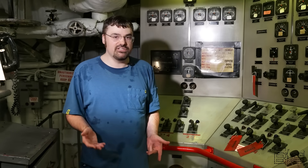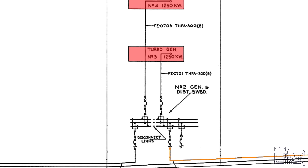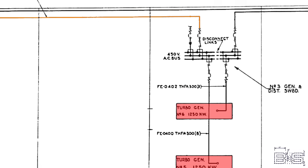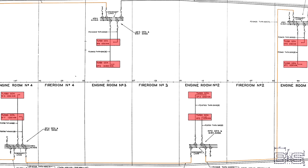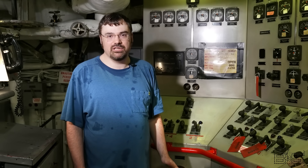There are some reasons you would want to connect all the switchboards together. Right now, because we have shore power going into switchboard number three, if you want all the switchboards to have power you'd better close the bus ties. But when we are running our turbo generators, if we close the bus tie to switchboard number four — which is likely tied with switchboard number three — we've also tied in switchboard number one. That means all eight generators of the battleship are connected together, giving us 10,000 kilowatts of power. So what is the problem with that?